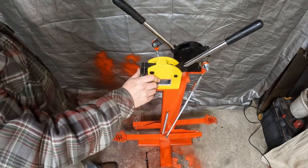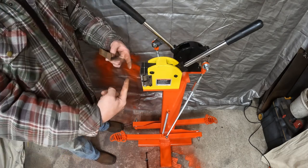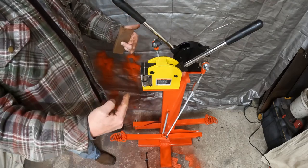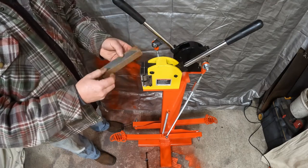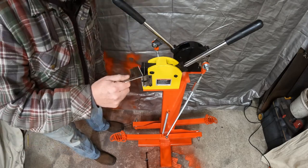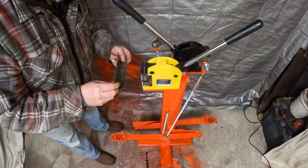The shrinker stretchers have marks on them, arrows going out or arrows going in. Basically like this or like that. And that tells you, is it gonna stretch the metal or is it gonna shrink it? So technically, this is just some 18 gauge. I just cut off a sheet and put it in the brake. I went well over 90 degrees, so I failed at that. But we're gonna try this together. I've actually never tried this, and we're gonna see how it does.